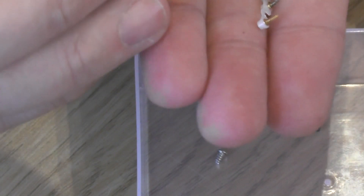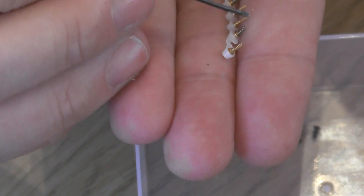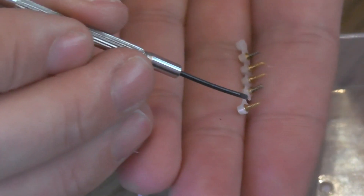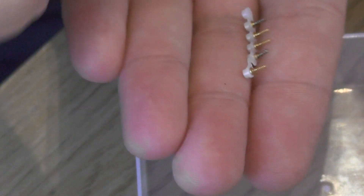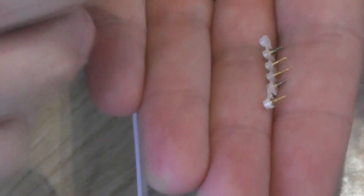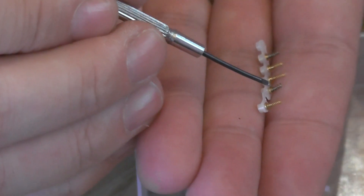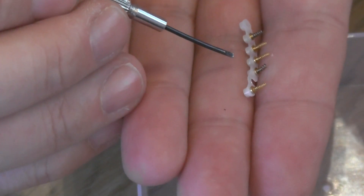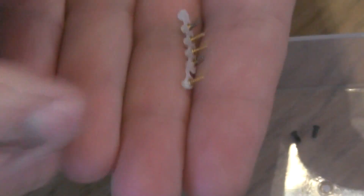One of the problems I had the first time I repaired the lens was I lost some of the springs. I replaced some by cutting existing springs in half and stretching them out to make them twice as long — not great because you don't get the same tension on the contacts, not a good long-term solution. You'll also see there are two springs here of different colours — they're steel springs taken from the little sprung post that holds your watch strap onto your watch. That spring is quite long and you can cut it into about four of these; it's about a millimetre in diameter so the right size to fit on the post. But they're stiffer, and if you get any humidity or condensation inside the lens and they rust, you'll lose the electrical contact. So that was a temporary solution, not a good long-term idea.